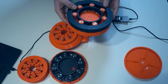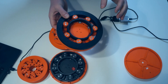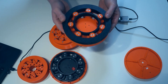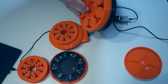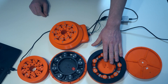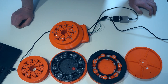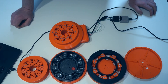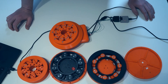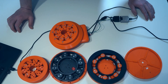I tried to put grease on the gears, reduce the number of planetary gears, change the gear ratios. I made more prototypes than you can see now. Some of them were better but the sound was still too loud. The printed gears are not precise and the input speed of the motor is too high, and it results in that loud sound.